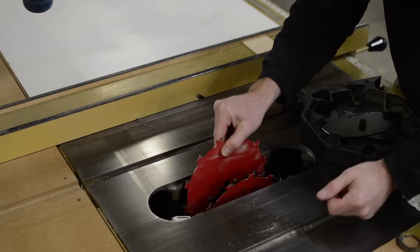I decided to cut a couple of angles on the feet in an attempt to give the sawhorse a better stance. Getting close to being done — it's now time to glue the legs to the feet. When you look at this joint, you'll notice there's a lot of glue surface area, which makes for a strong joint. This is probably one of the strongest ways you can glue two pieces of wood together. I bring this up because it's a fairly easy joint to machine — a table saw or router will do it real easy. So next time you're working on a project where you need some strength in the joinery, consider doing a lap joint.